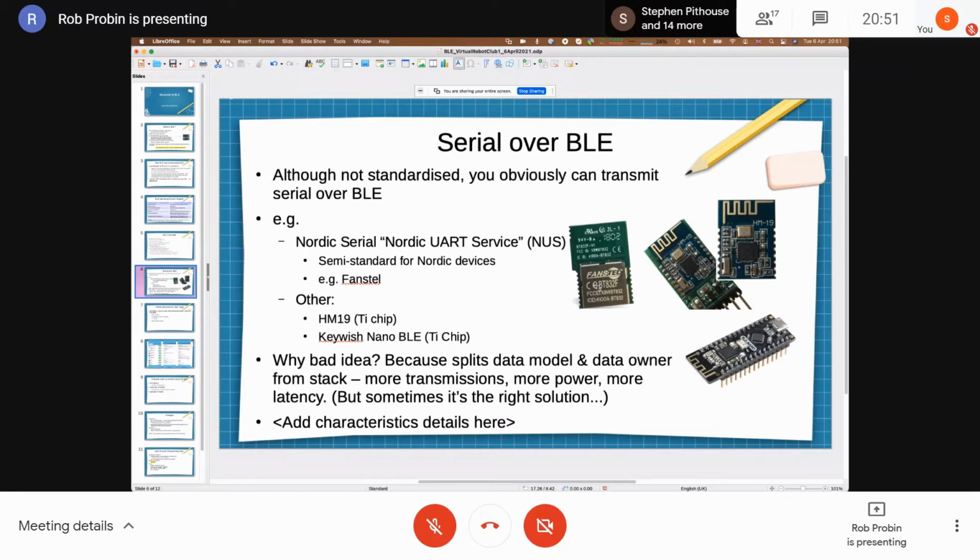So if you've got multiple micros, obviously, if you get requests, you've got to keep that radio alive for as long as it takes to round trip that through the other micro, get the data, reformat it, and send another set of packets. Whereas with BLE, the way it was organized with these characteristics, the stack itself is aware of the actual data. So if you've got like a 12-byte string, for instance, that's listing the last error code, the stack has direct access. You've got an agreement between the application and the stack, and the stack can just send that data straight up to the central without having to go through the application or a second micro.